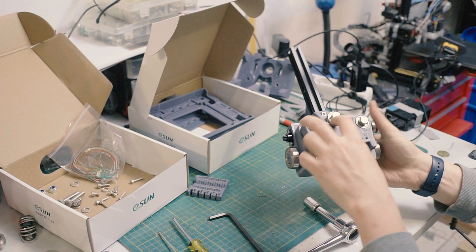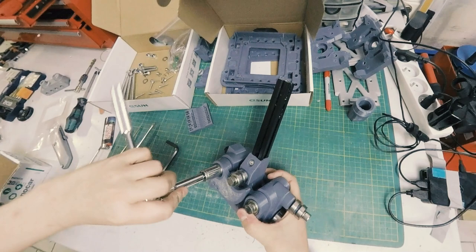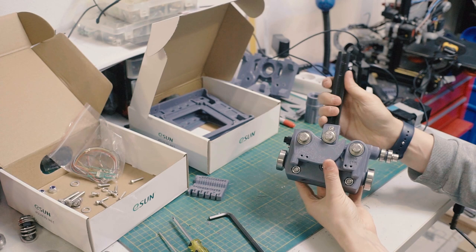And if it feels a little bit stiff, it might be because the bearing's being compressed too much, so walk it back a half, like a quarter turn. Maybe a half turn. Just so that these move smoothly. And there we go. And that's our cams, right?